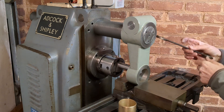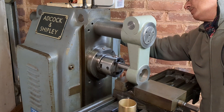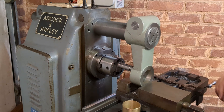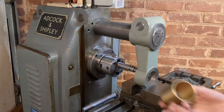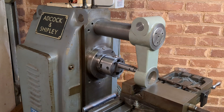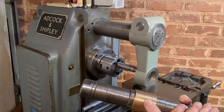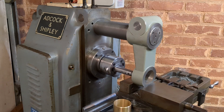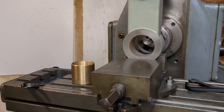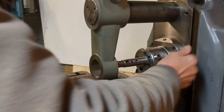I've just very slightly nipped the cotters on the top here — barely — but just to make sure that if there is any clearance we've taken that out, and hopefully that will give the best possible alignment. I'm going to put a small cut on and start opening this out. This is the bush that I've got — I was very fortunate, it was in my stock of bits and pieces and it just happens to be the right diameter for the journal. So all I need to do is bore this out and press it in. I'm carefully adding cuts to the boring head incrementally and measuring regularly.